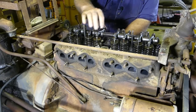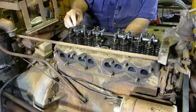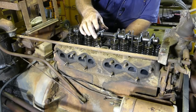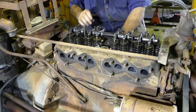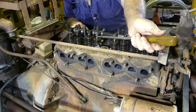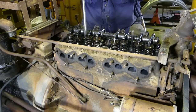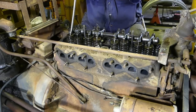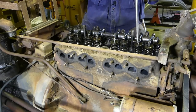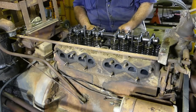At this stage you can turn the loose pushrods and just see if they're bent or not. Check the clearance on that one as well — unbelievable, that's about an eighth of an inch. If we push that valve down, it's coming back home okay. They all seem to be moving, going no worries.